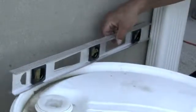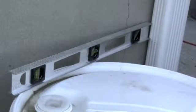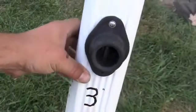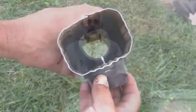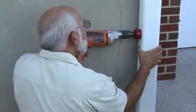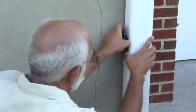With your barrel in place, set a level on top, move it over to reach the downspout, check the bubble, and make a mark on the downspout level with the top of the barrel. Make another line in the middle of the downspout. The FlexiFit diverter works with two sizes of downspouts — two by three inches and three by four inches — so be sure you mark and drill only on the three-inch side. Use the largest hole saw to cut into the downspout, then make sure the arrow points up as you squeeze the diverter sides and push it straight into the hole.